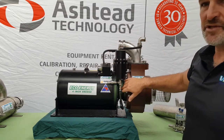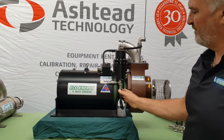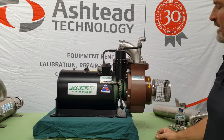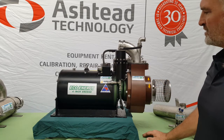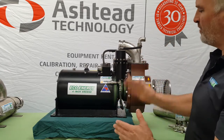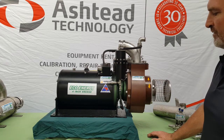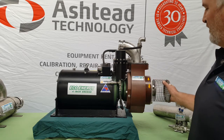This is the same shaft seal system that we use throughout our fleet on hydraulic dredges. It's been a very, very efficient system. We've actually gone one better in that we're using a rising rate regulator system — the more water pressure is built up, the more effective the shaft seal is. So two separate compensator systems: backup upon backup keeping oil inside and making the unit as reliable as possible. Very well proven throughout the fleet, with the same water pump as we use across our fleet.